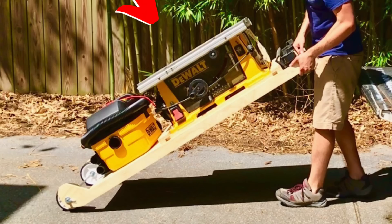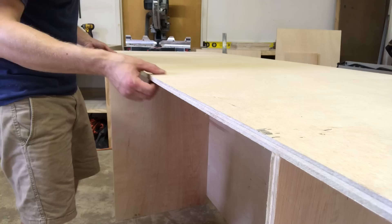I've actually done this before on my channel in my table saw cart video, but that one didn't get watched a lot and I thought this detail might have gotten overlooked. So I'm giving it more focus here. The reason this is an issue is because of overspanning. Half-inch thick material just cannot bridge a gap that wide. You instantly get flexing in the lumber — just look how much I can deflect it with my hand. Clearly, that's not going to work for a countertop area. I wanted to be able to set heavy things up here, possibly do some work on it. I don't want it to bow.